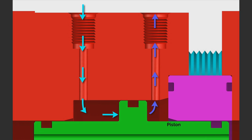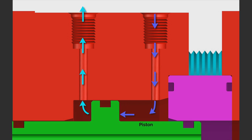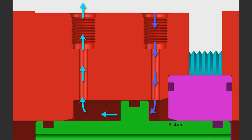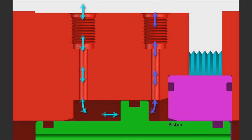This is accomplished through the use of a balancing chamber and careful design of the interior surface areas so that they completely cancel each other out. The design also eliminates the need for a valve stem that penetrates through the valve body in order to move the plug against the seat. By doing this, the need for stem seals and even a conventional actuator are eliminated.